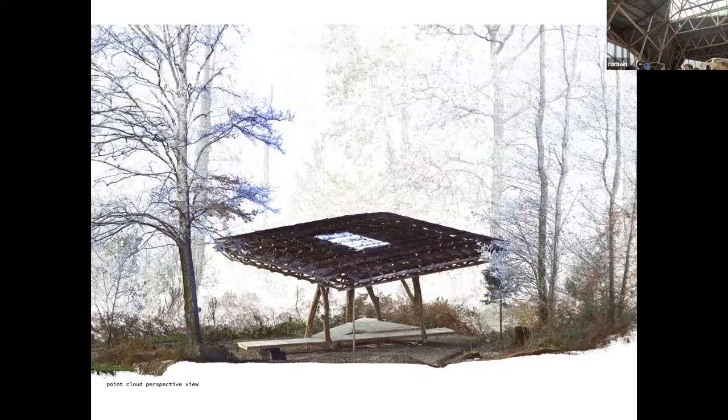I think the other thing that's also worth mention is we started out, it wasn't going to be a field station, it was going to be some conversion. So the top and bottom of these chords had to almost be able to take finishes. Right, so they had to be able to take sheet materials. And also with the roof material, it's much easier to stick a screw in the corrugated metal onto a nice straight bit of chord rather than around it as well. It's a bit of practicality.